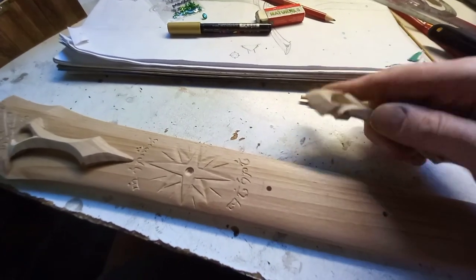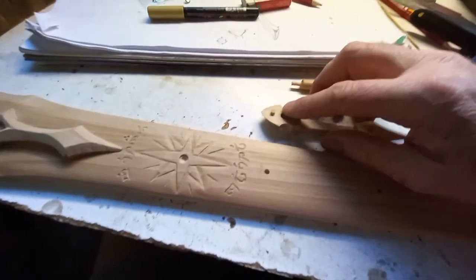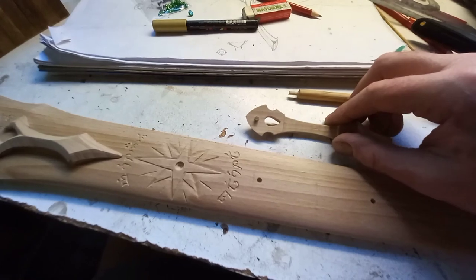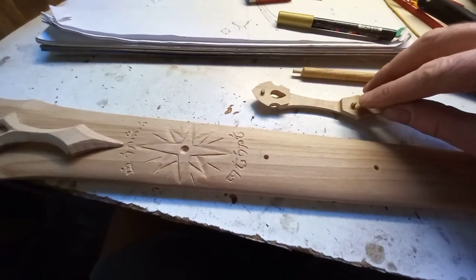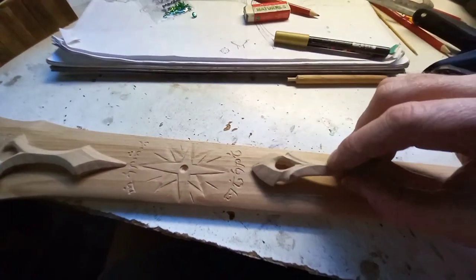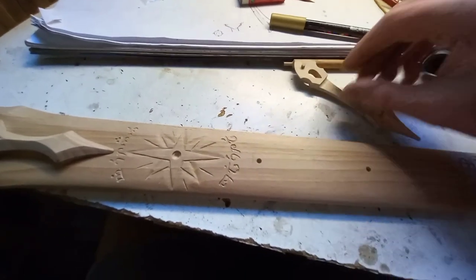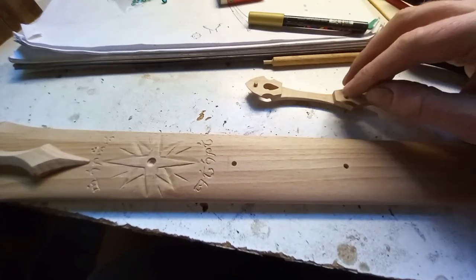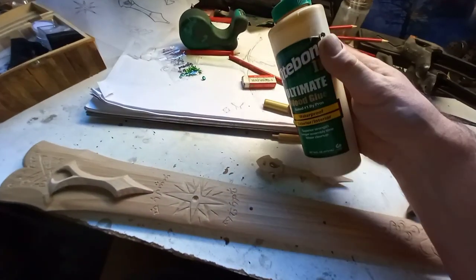Just marking the dowel position — I've put them in the bridge sections first, the locator first, and then I've put a tiny drop of paint on the centers of each dowel. I've had center lines penciled on the scabbard, positioned it, left a little mark, and then double-checked my measurements by measuring center to center of the dowel before drilling. Pretty straightforward.